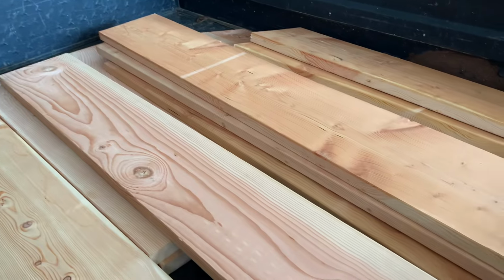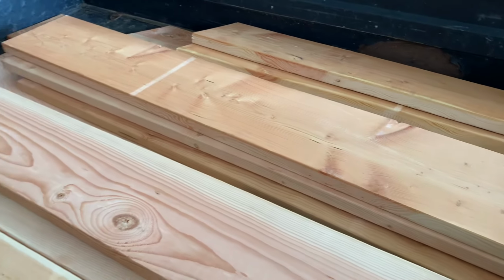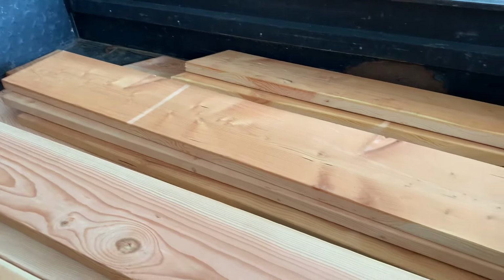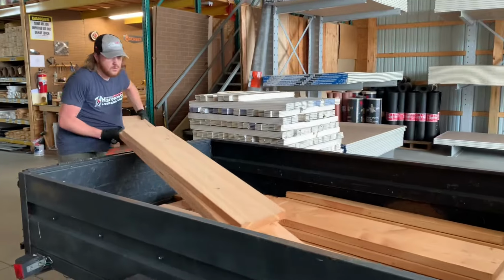So I'm using 2x12s. They came in 14-foot sections. So since I'm building 4 garden boxes, I got the 14-footers cut down into a 6-foot and 2 4-foot sections. However big you want to build your boxes, just keep in account that for each box you need 4 pieces of wood. You need 2 of the long side and 2 of the short side if you're building them not square. I will leave the specific measurements of what I had cut in the description bar below if you want to make exactly the same type of thing that I did.